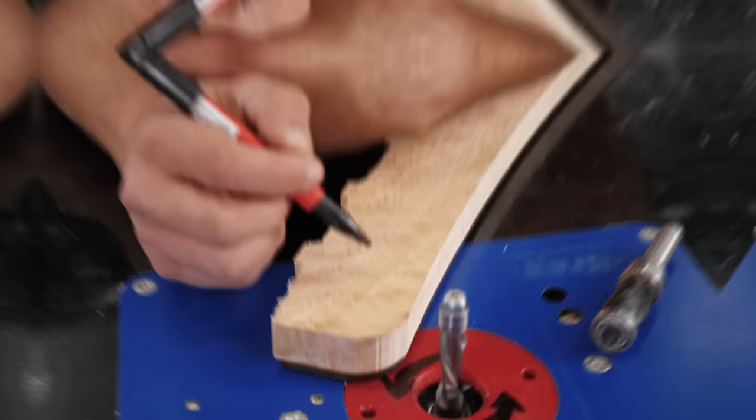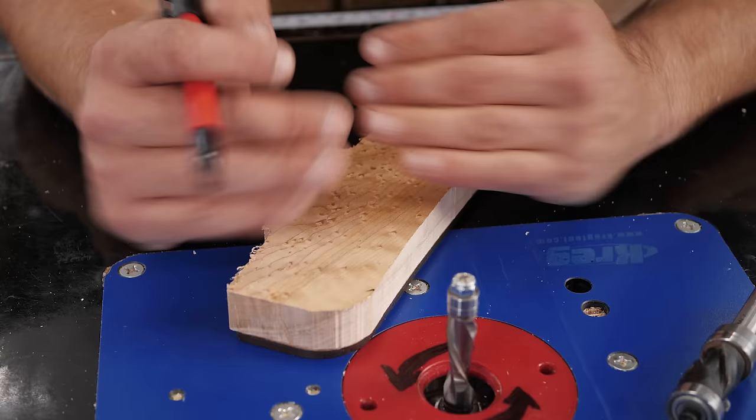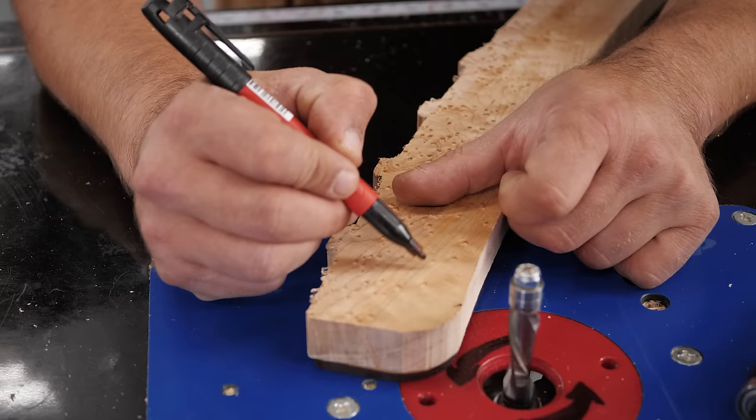The reason I chose this piece of maple is it has really defined grain, and maple is one of the hardest types of wood to route. I use this compression bit 99% of the time because I've never had an issue going around corners or with end grain. In Jay's Chairs project, there's a quarter inch curve, so you have to use this bit for those inside curves.